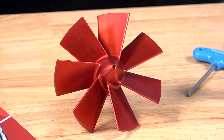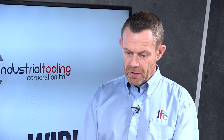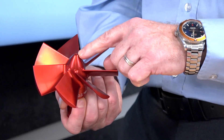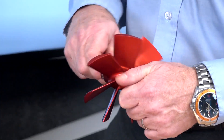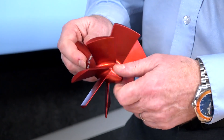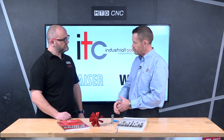The chip fan is a great idea. There are fans out there made of plastic which fold and can break, but this is actually machined from a solid billet of aluminium, so it's incredibly strong and reliable. It has the added advantage of a through coolant hole through the middle, allowing you to blast the component or even a bore with coolant and flush it out. You can also put through air, then spin it up, which creates a downdraft to blow swarf and chips off the table.